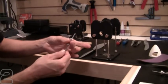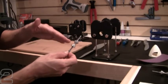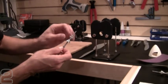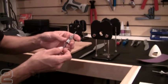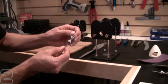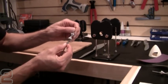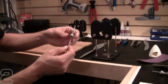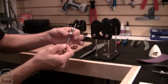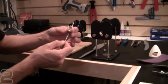You mount your prop between the two cones, or you can spin one cone backwards to accommodate a shallower hub. You don't want the two cones to touch and the prop to be loose in the center. Once you apply the cones, move the fuel tubing forward until you have a little bit of tension in the spring — that'll keep the whole assembly tight and both centering cones pressed against the prop so it tracks properly.